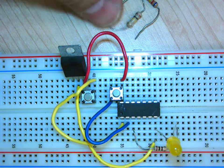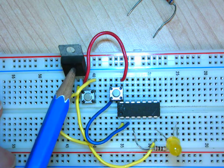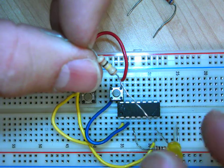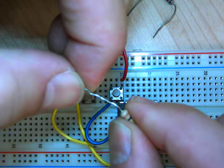So you take your 2 high value resistors, and now we need to go to the ground from each of them, right? So look how convenient that is. We got a ground on pin 7 here, right? Because that came from my 7805 middle pin, went straight to pin 7. So again, look at this resistor. Okay, so that's been fixed by me, but it's still all bent out of shape. Okay, that doesn't need to happen.